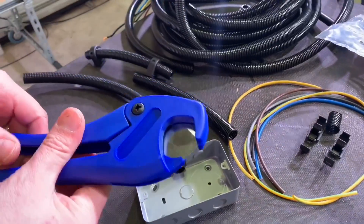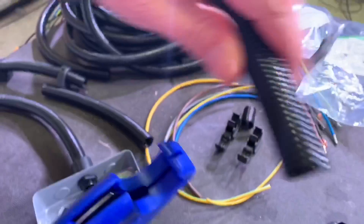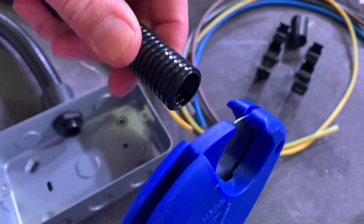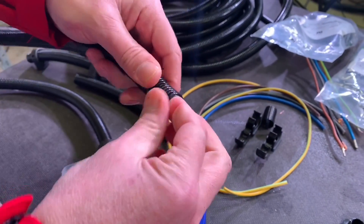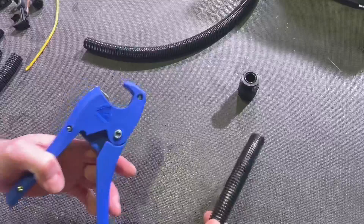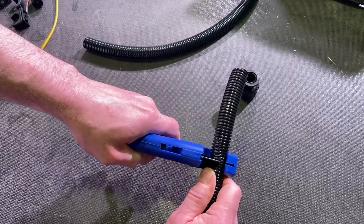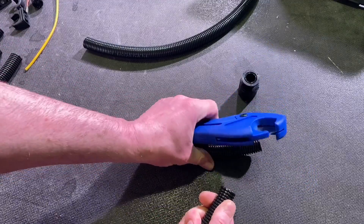Let's do the easy one: how to cut it. So we've got these normal plastic conduit cutters here - just put your conduit in. That gives a nice, clean edge. If you use a hacksaw, you'll probably end up having to deburr it. Little top tip: if you don't want your conduit ricocheting around the room when you cut it, just give it a little turn as you start the cutting process so the Flexicon conduit doesn't fly off.